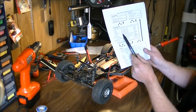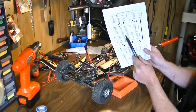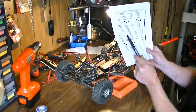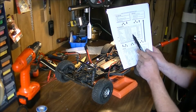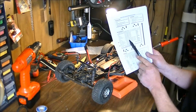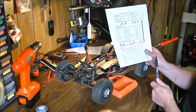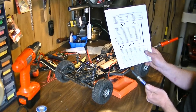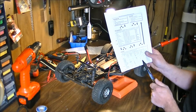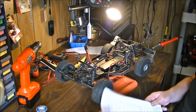The tone codes are: one long beep, two short, one short, one short tone, two short tones, three short tones, four short tones, one long tone, one long one short, one long two short. I got confused once by two long beeps very close together — that was for setting timing on the motor. There are four levels of timing you can set, and I haven't seen much difference between them, so I've got mine at the high level.